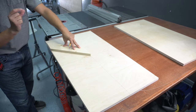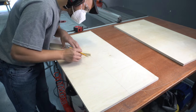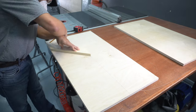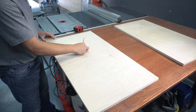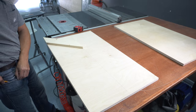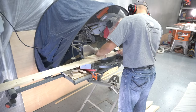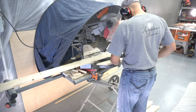This lets me know exactly how much I need to cut off. Then I go back to the miter table and cut just outside the line I previously marked. I make sure to leave about an eighth of an inch in excess material and then come back to trim it later with my router. I trace the first 1x4 on the quadrant, then move back to the miter table to cut the next piece to size. At the miter table I use the previously mitered piece to trace and cut the remaining boards I need.